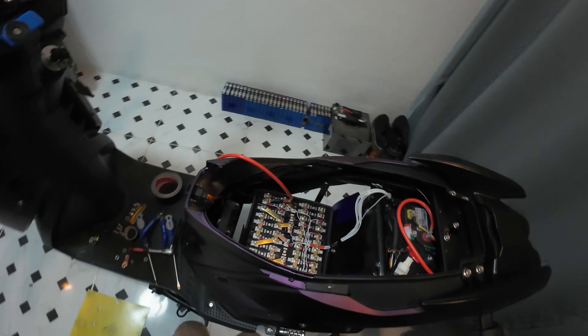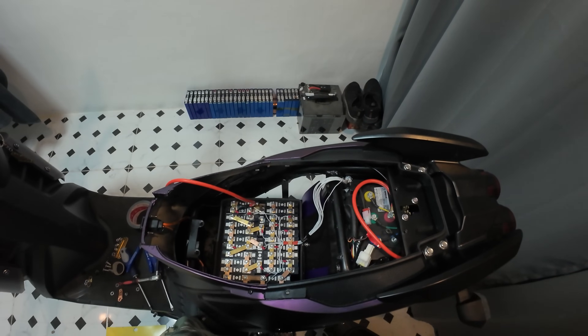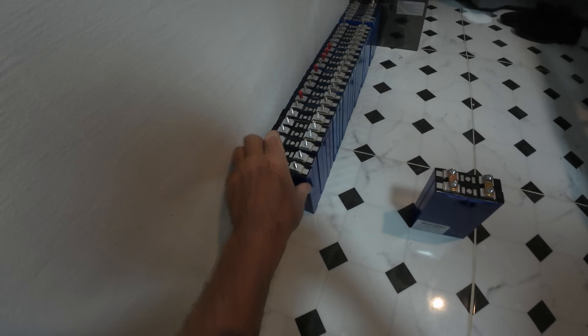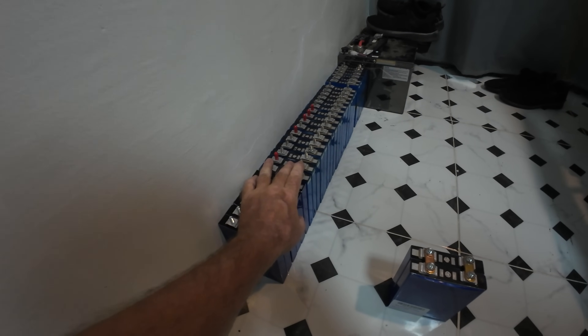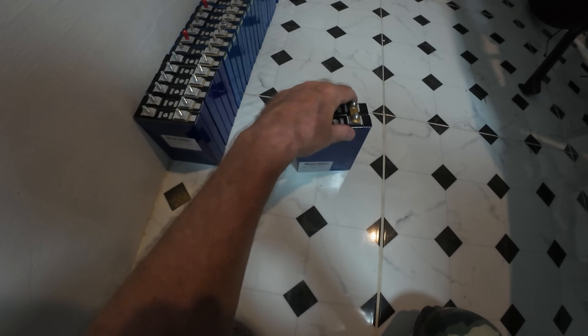I've got to carefully get this out. I put my glasses on so I can see what I'm doing, grip it tight, and pull it out. There are the two parallel cells — I'm going to replace them with two others. These replacement ones are different, so I don't know them yet. I don't expect them to be perfect given CATL cells vary completely in chemistry. These two originals can't be drained below about three volts without the voltage dropping very quickly, so I need to independently test the replacements.